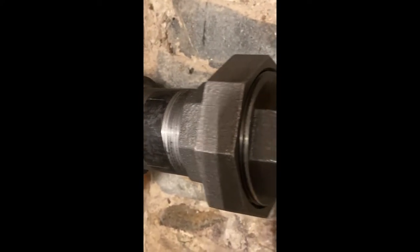Here's what our mock-up looks like - we didn't engage the threads all the way. It looks good, that's why I put a 45 in. We got enough pipe here and pipe on this side, then we could probably stretch it. Might have to move the bracings - we have to be careful because we have some other connections over here to the radiator, so we won't be able to move that. I think we can make this work. Might go with a little bigger nipple there because I have a lot of thread to chew up. Meanwhile we'll look for a 45.